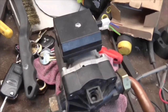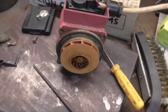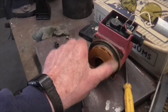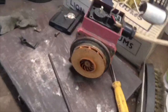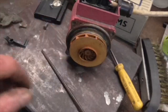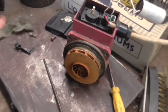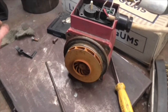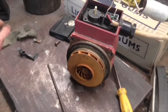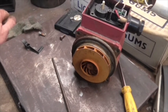Well, as you might guess, it doesn't fit. And this one is definitely jigging - it doesn't work at all. Just as soon as you turn the power on it just magnetically locks. I've tested the capacitor and it's okay. So I think we've burnt it out, or it was burnt out, or it was on its way out when I took it off - because I did change it as a suspected faulty pump from my mum's central heating. So the next thing to do is pop down to Michael's and see if he's got one.